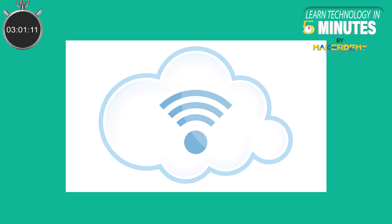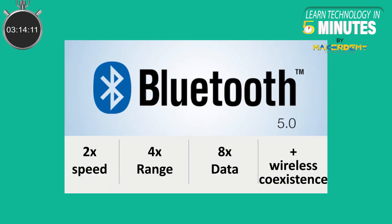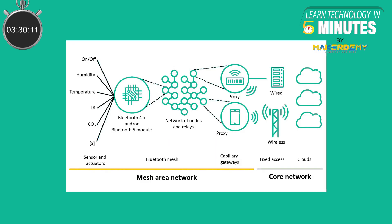Typically, connected devices use Wi-Fi connectivity to connect to cloud services. However, Wi-Fi-only devices possess difficulty in network configuration and also fail to provide reliable configuration feedback to the provider. The availability of Bluetooth provides easy discovery and control in the local environment. The ESP32C3 has added support for Bluetooth Low Energy 5.0, which has an improved range of almost 100 meters. It also supports the Bluetooth Low Energy Mesh Protocol, which helps to control and communicate with other Bluetooth Low Energy 5.0 sensor devices in a local network.